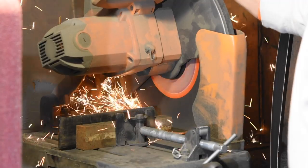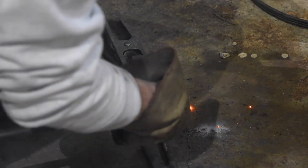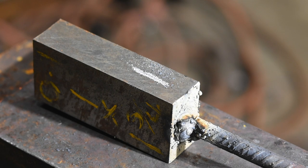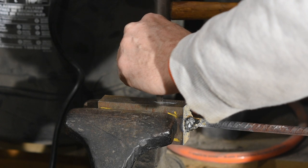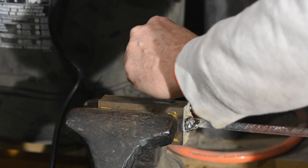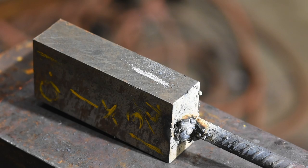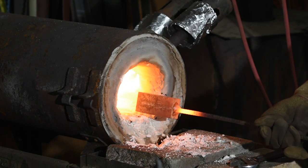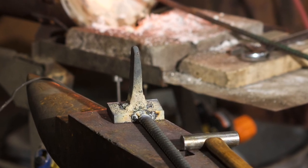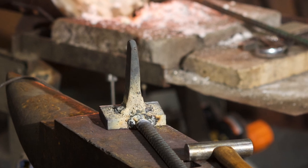The biggest trick in forging hafted tools is getting the eye right. If it's not square or if it's off-center, it'll take a lot of work to get things right and it may never function correctly. So after welding it to a handle, I'll carefully measure and score both top and bottom with the eye's location. By chiseling it, I'll actually be able to feel the correct location with the punch that I'm using to make the hole through the body. The punch is made with a flat top so that as long as it's in full contact with the flat die on my hydraulic forge press, it should go pretty straight down into the steel.